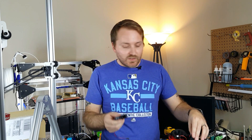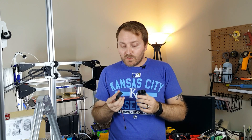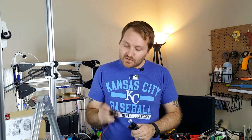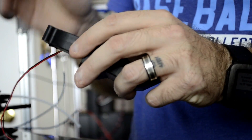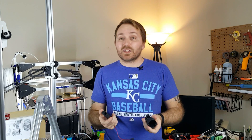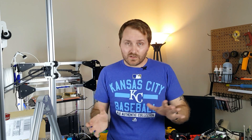You can use a blower fan with a shroud-style setup. On Thingiverse — I'll post a link below — there's an object that converts this blower fan to fit the space of a 40mm axial fan, so you can get blower-fan pressure into your fan duct. It's not the best-case scenario but may still be better than using an axial fan. That's the basic fan rundown and why you'd choose one type over the other.